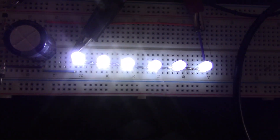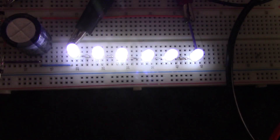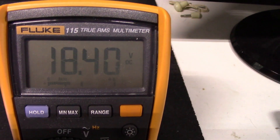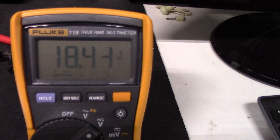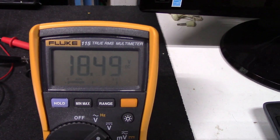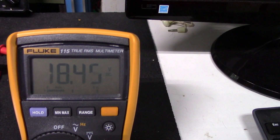As you can see, the camera finally irises down — they're pretty bright. Here's the voltage across that string right now: 18 and a half volts at about 3.8 milliamps. So you're not going to disconnect from the local utility, but 70 milliwatts is a fair amount of power.